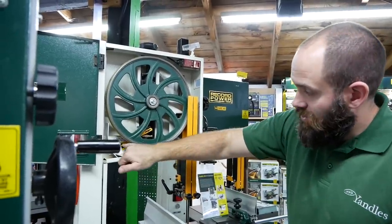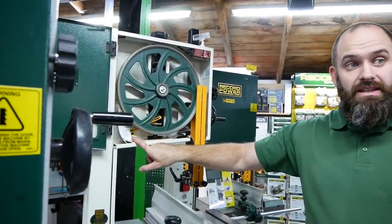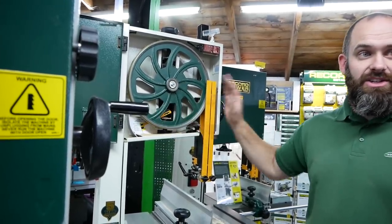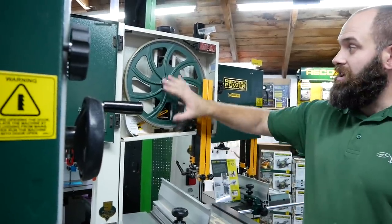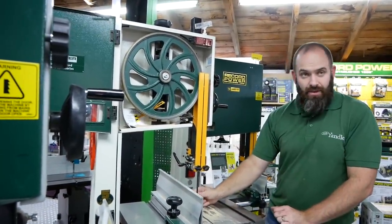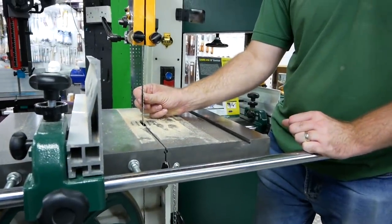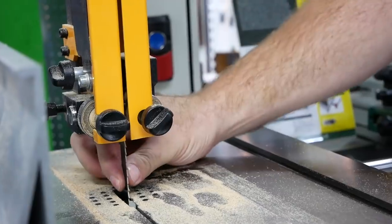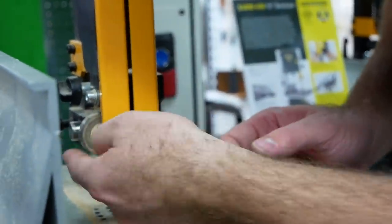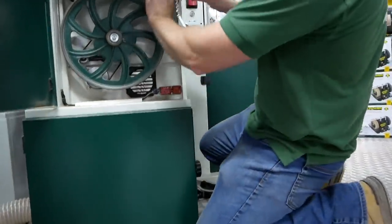You then apply tension. There is on here a little arm that shows you where the tension should be, depending on the thickness — that is a rough guide. If for whatever reason you're finding that you're tensioning a 3/8ths blade but it's way too loose, then play with the cam lock first to see whether you forgot to put that on, then apply the correct tension. You shouldn't be able to deflect a blade too far — so you can push it a little bit, but your deflection should be very minimal. There are guides underneath as well — roller bearing guides, top and bottom.